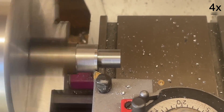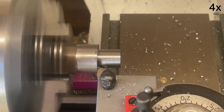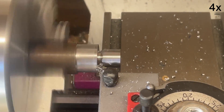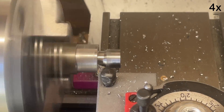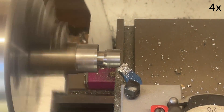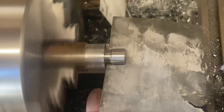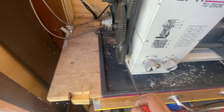For this I need to cut an M14×1mm thread - a non-standard pitch - so I'll have to single-point thread it on the lathe. I'm now cutting the relief groove for that thread. The major diameter is 14mm, which I've already rough-turned and will dial in with fine sandpaper. The larger diameter section will be a press fit with the hand piece. I was about 1-2 hundredths of a millimeter over on the thread diameter, but that still works.